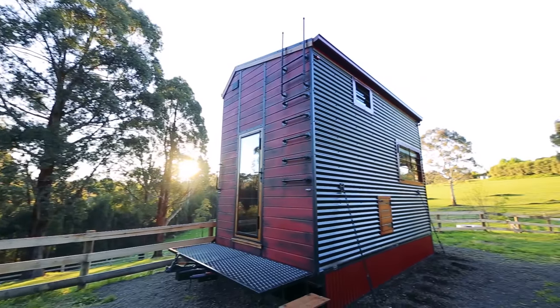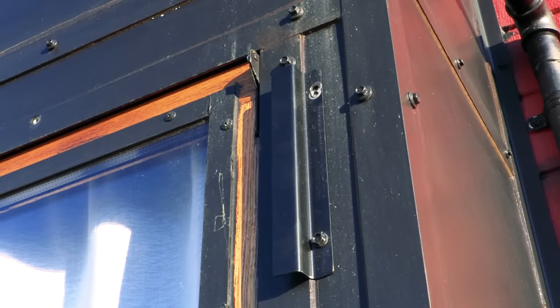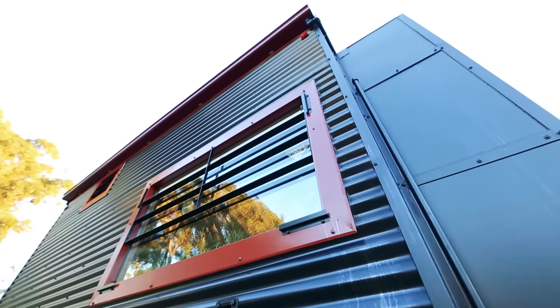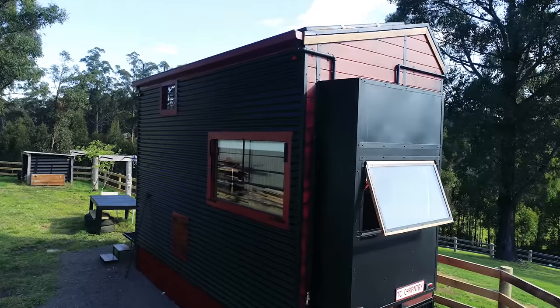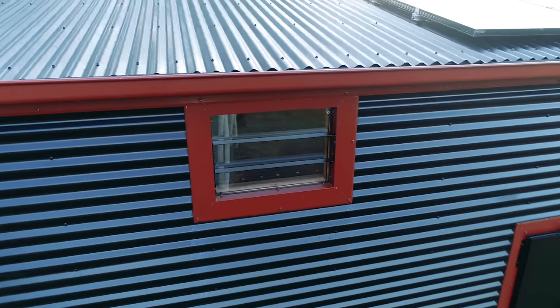The windows and doors were all made on site. There are two types: the window sash is made out of timber, glued together and fixed up, and then there's an exterior colorbond flashing — a tin flashing — which forms the outside lip. The glass is set straight into the timber frame with no timber reveal. The glass itself is double-glazed, argon-filled, with toughened glass. Toughened glass is the fireproof measure, argon is for insulation, and double glazing is standard.